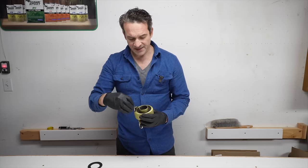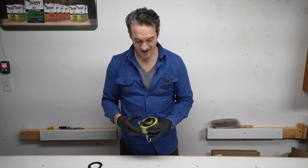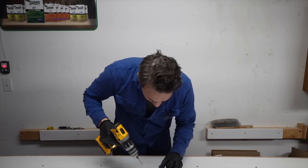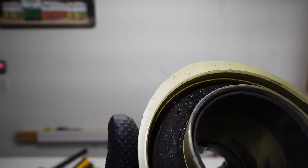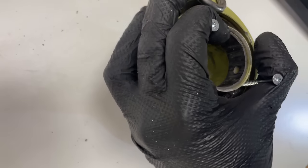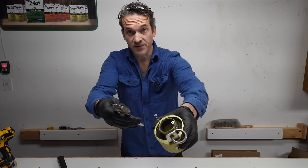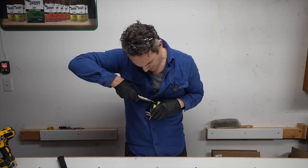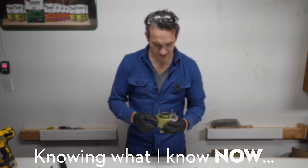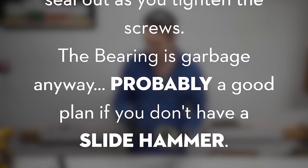No really easy way to get that out. What I like to do — sometimes these have a little metal cage in them — is drill a small hole and put a screw in there and try to yank them out. So we'll drive a couple of screws in here. We've got two screws in there, so we're going to try to pull this out now. We'll try the vice grips to see if we can get the seal to move. I didn't think so. Now I might be able to push the seal out by driving the screws in further, but I'm not sure what it would be pushing against, and I don't want to damage anything inside. We'll try to pull it out, and if that fails maybe we'll resort to that.